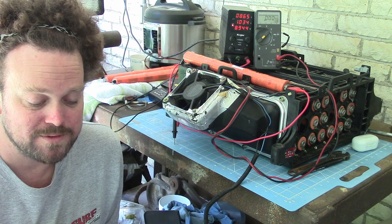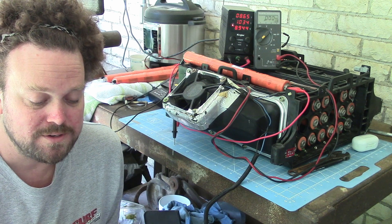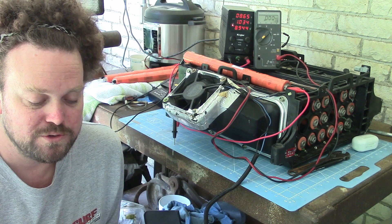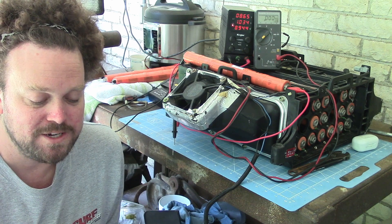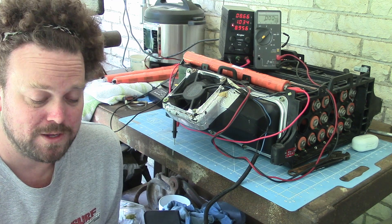As a ragtag battery with zero volts on its terminals is charged, stronger cells reach their full charge much faster than those whose polarity has been reversed. So as the weaker cells are catching up, the stronger ones are being punished by pushing current through them for a long time after they have been fully charged.